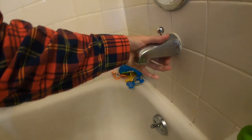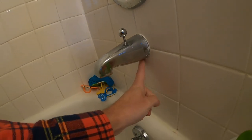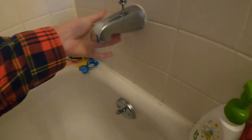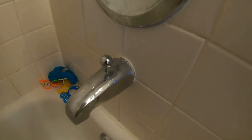There are a couple types of faucets here — you might have a set screw on the bottom, which is pretty rare, or a basic twist-off where it unscrews. I don't have any set screws under here, so I want to razor blade this little silicone seal just to make it easier to unscrew. I'll go ahead and pull out the parts, then head to Home Depot to buy a couple new parts.